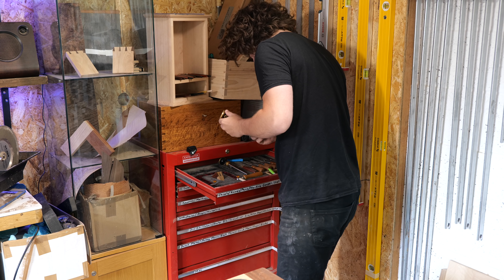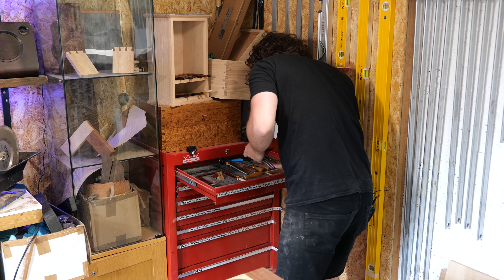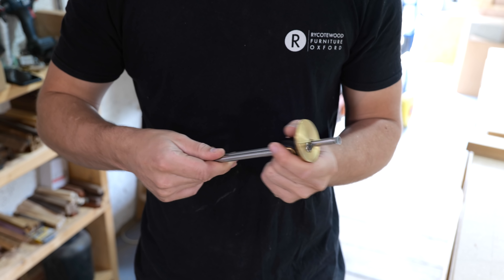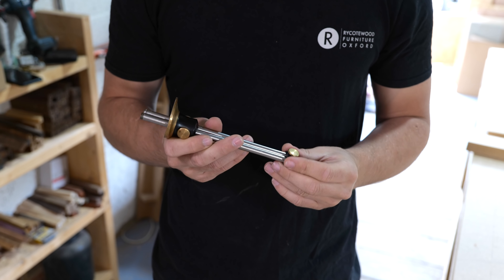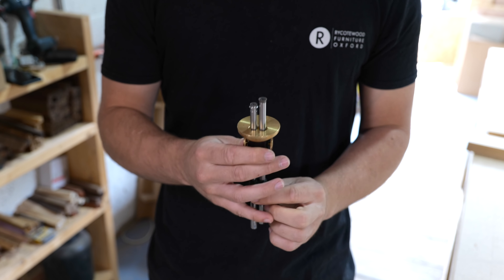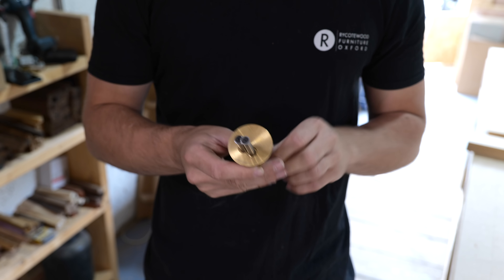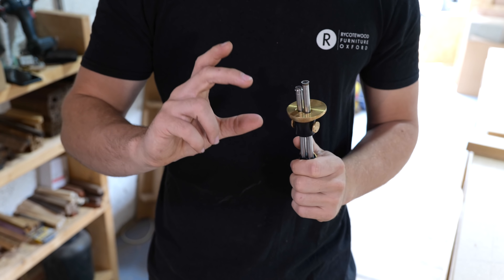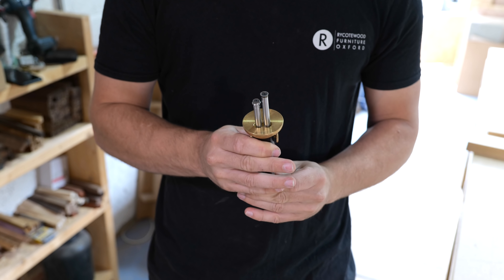Providing I haven't lost it, I should have a mortise gauge and a locking piece that goes on there. Here's our mortise gauge — two rods that move independently of one another — and then we've got this little locking piece as well. We'll lock these at the desired offset from one another. Let's say we want the bridle joint to be around 10 millimeters, so I roughly space these 10 millimeters apart, lock them together, and then because we've got that change in thickness between the two components, we can move these in unison but offset from the stock differently.